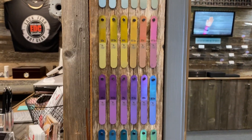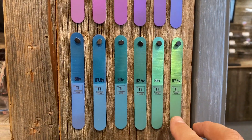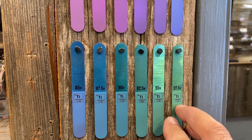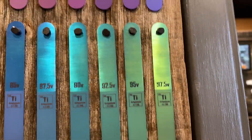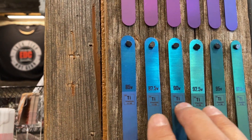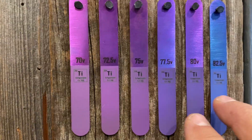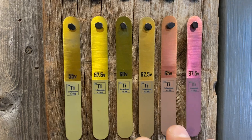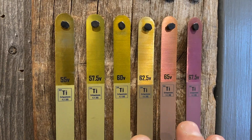When we're looking at the titanium anodization spectrum, we're ranging from just under 100 volts at the highest, because anything over that starts to go back to gray. We get a nice teal-ish green color here, and you can see there's not a whole lot of difference between the finishes there. But you'll see it change quite a bit as it comes through these nice blues, aqua blue, and then into purples — a little splash of pink and a slight orange hue, but more pinkish around 65 volts.